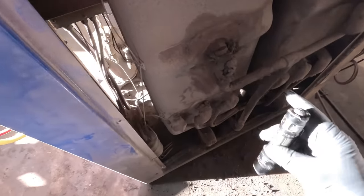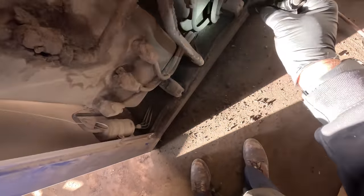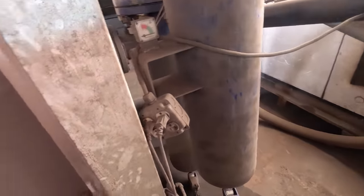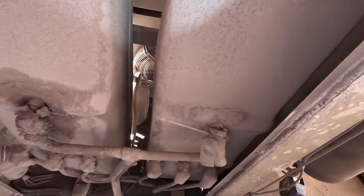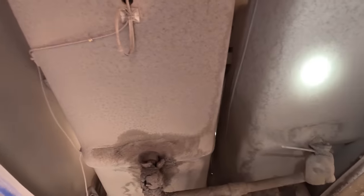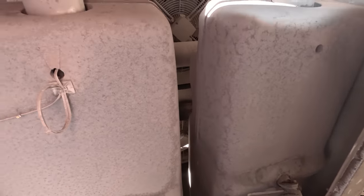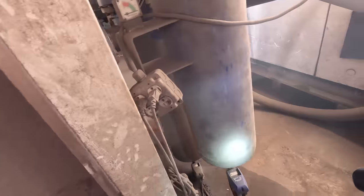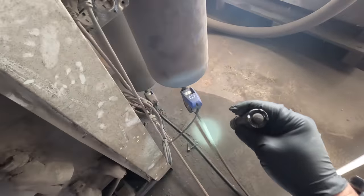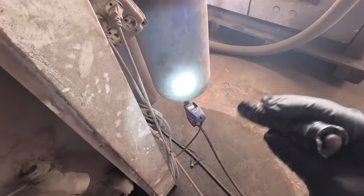Essentially we've got a compressor here with a condenser, which is pretty obvious. Come around the back and you can see there is a dryer, which comes to what looks like a capillary distribution tube of some sort. It goes into a plate heat exchanger — air comes in and out. It's in parallel. You've also got desiccants or separators and an auto drain. Hit the test button and it'll blow out the bottom, automatically getting the moisture out of the chamber.